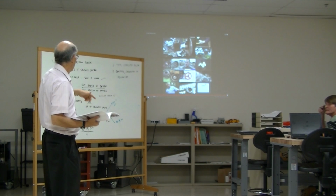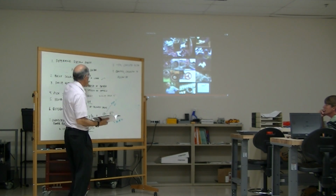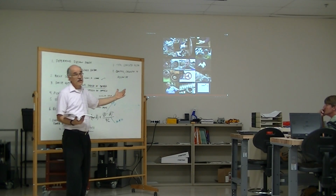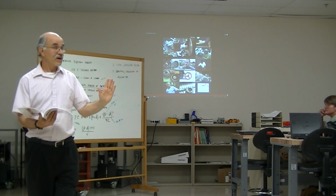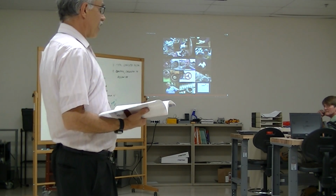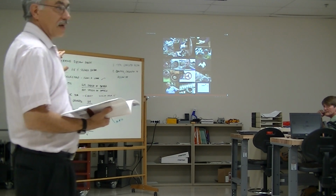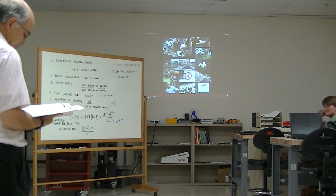6.5? Well, no, it's not always going to be 6.5. Remember when we did this step up here, that was 6. So no, it's not always going to be 6. Whatever it is, though. So if your design horsepower is 3, your corrected horsepower should be 3.1 or 3.5 or 3.6. And if it's not, it means you probably chose the wrong small sheave, and you got to go back and make that sheave a little bigger, and then it should work out. I don't think any of the problems do that. If I remember right, I don't think they do.